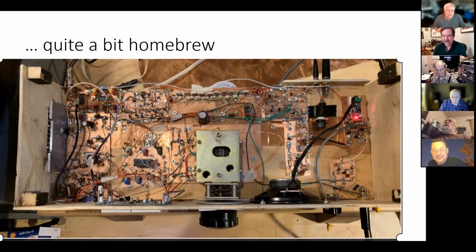So, you can do it. How hard is it to measure those parameters on those crystals? It's not hard. There's a method called the G3UUR method. You build a little device, and all you really do is you switch in 30 picofarads, and you measure the frequency before and the frequency after. From that, you can calculate the CM and the LM.